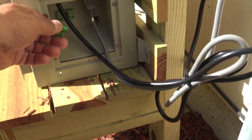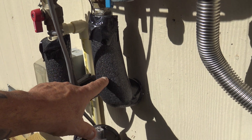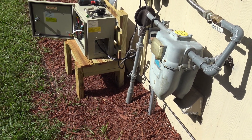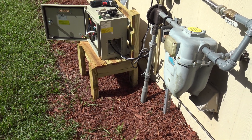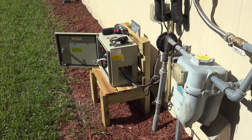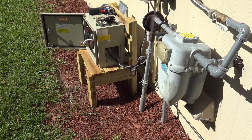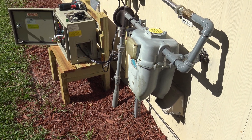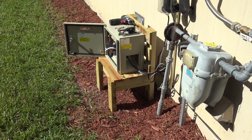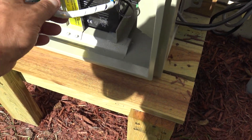This green port is where the water flow sensor plugs in. The water flow sensor gets installed on the cold water side of the tankless — it will sense water flow and activate the Yugo, which will otherwise stay dormant. Once I shut the power off, the Yugo will power the tankless just like a regular outlet. You'll get almost 13 hours of shower time with the water flow sensor, and around 8 hours without it. I will be installing one on a large project here in Florida.